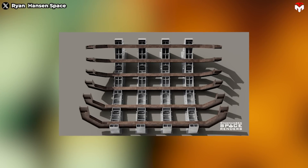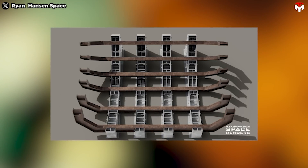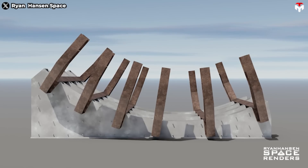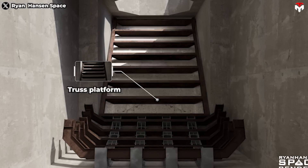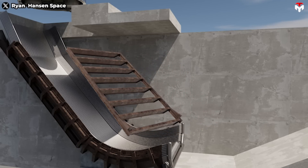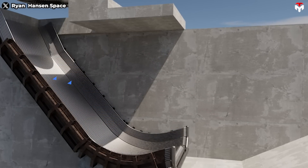These pedestals feature a hollow section with studs or pegs intended to be filled with concrete upon installation to bolster sturdiness. The flame bucket is shaped into a curve to snugly fit against curved walls or transitional surfaces within the test stand. The secondary component is the truss platform, looking like a stair. Once fully assembled, this part will be situated on the inclined surface of the test stand beneath the aperture, initially absorbing the impact from the engine's energy discharge.